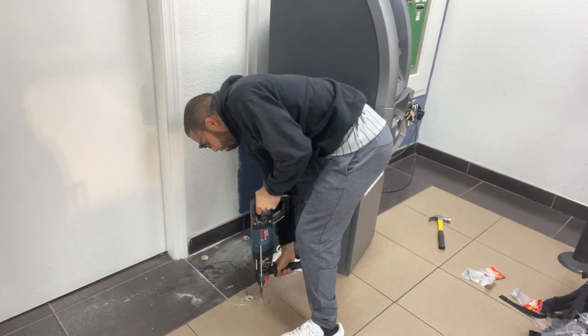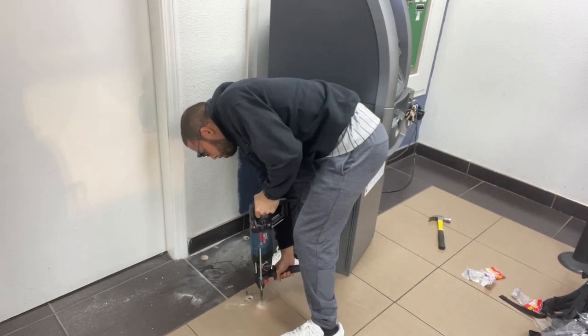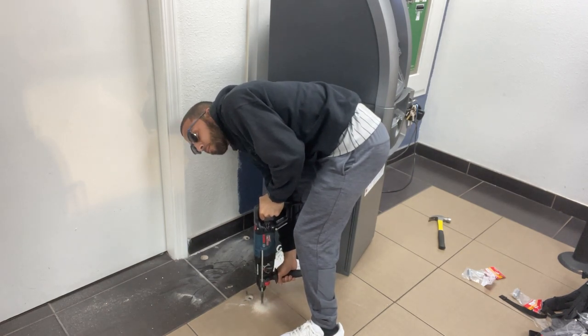Unfortunately, as I'm trying to do that — when I do this process and drill the anchor holes, I like to drill deep, just in case I have to remove the ATM. All I have to do is hammer it in and it flushes into the floor, which makes it a lot easier and cleaner when removing an ATM. But I didn't anticipate moving the ATM, so now that I'm trying to put it back on the old anchors, they're getting flushed into the ground because of the ATM's weight. So I'm just going to put new anchors in next to them.